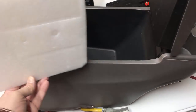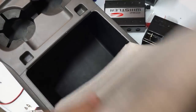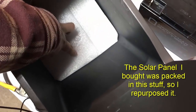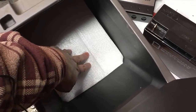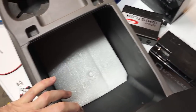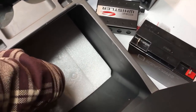The first thing I'm going to do is cut a piece of closed cell foam to fit inside the console at the bottom. You can buy closed cell foam at a craft store — I got mine with the solar panel and trimmed the edges to fit snugly. It lets the battery sit and sink in a little, absorbing vibration. The less vibration the battery sees, the better off it'll be.